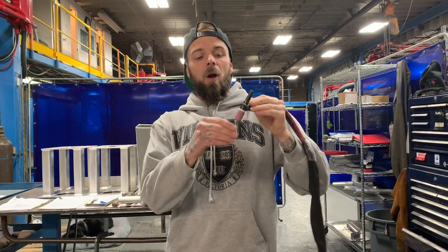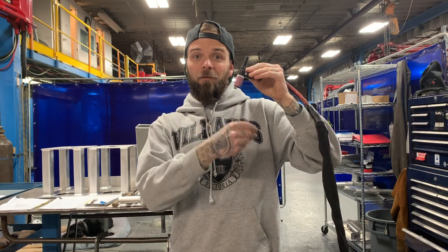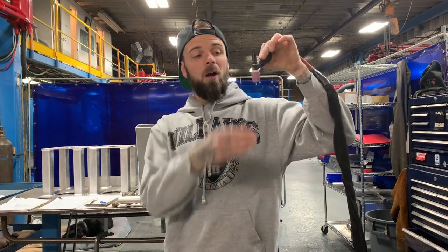Some people try and burn it off on a piece of scrap. This does work, and maybe if you're just beginning to learn how to TIG weld, doing this here and there might be okay. But the more times you dip it, your arc is going to tend to wander back and forth. Even though you may be holding the torch completely perfectly, your arc is going to start dancing back and forth. So if you dip your tungsten, just swap it out for a new one.